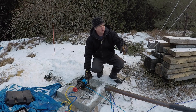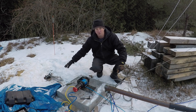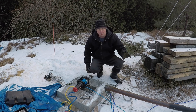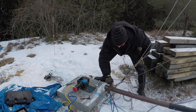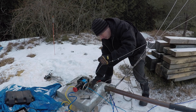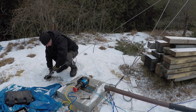Okay, so now the tower is down. It's still not attached on the back here, so we have to slowly and carefully disconnect the backstays off of the gin pole and connect them up to the actual anchor in the ground. It feels a little bit hectic doing it because the tower is so floppy at this point — it bounces around — so I just go slow and steady and everything should work out. We're going to slowly pull off the lowest one, and as long as we keep tension on it, everything goes fairly smooth.